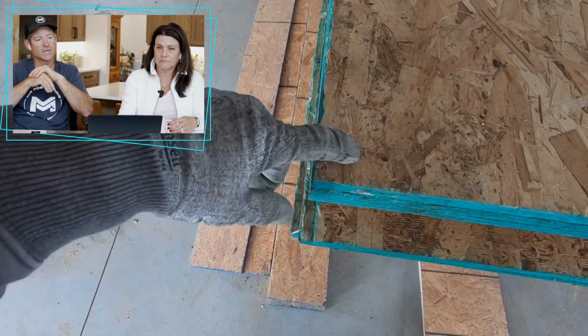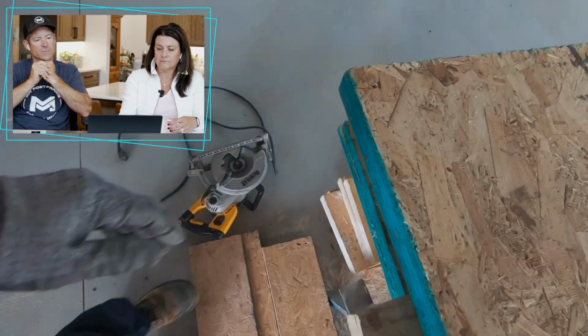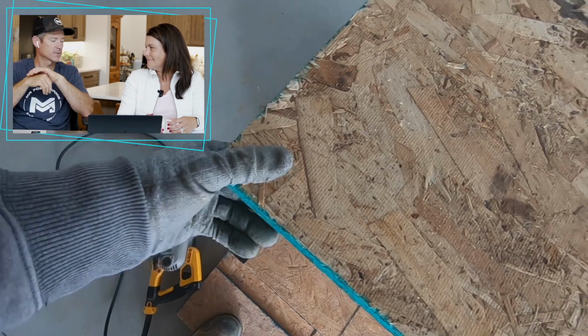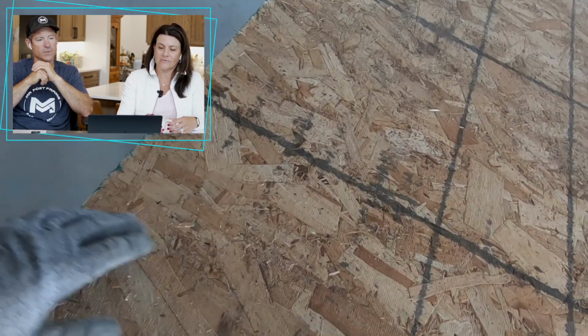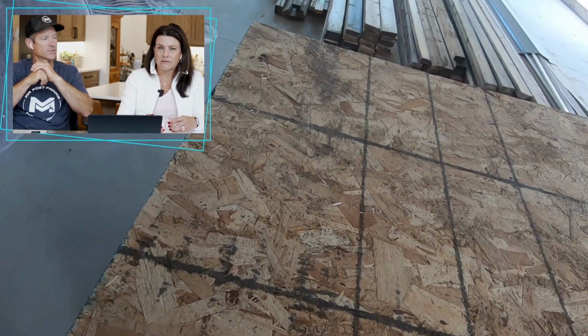You still cap off the top of your wall cavities. You need that for a fire, so fire can't spread to your attic. And you've got to do some things like that. But it's very little change really if you're spraying the whole thing in.